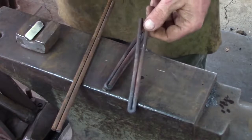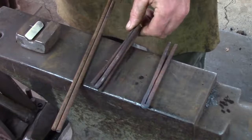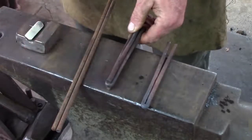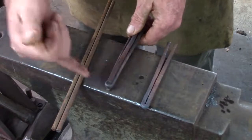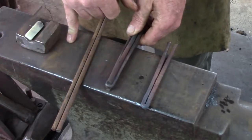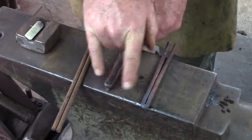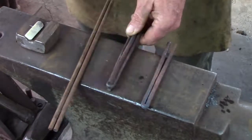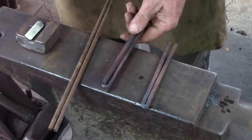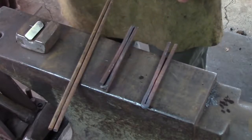Each length is folded in half to make a staple, and the staples are fitted end to end to make the basket. The staple end — the curved bit at the end — does a number of things for us. Firstly, there's a little bit of extra material to help with the weld. Secondly, as I'm welding and driving that in, that end stops the two side pieces from spreading. And thirdly, it makes it easier to hold in the tongs — I don't need to wrap the ensemble with wire to hold it together as I'm taking my heats.